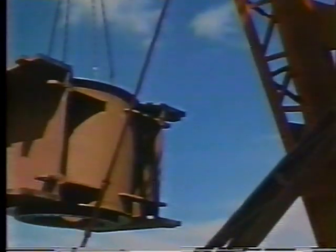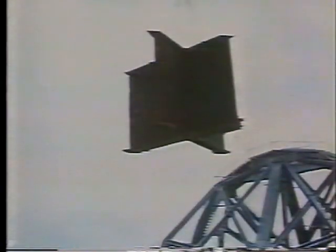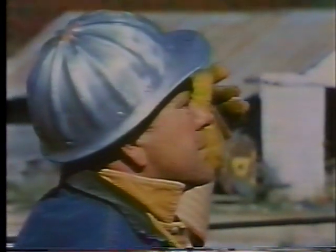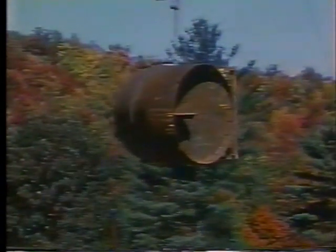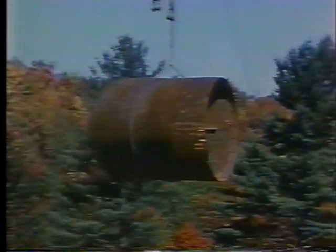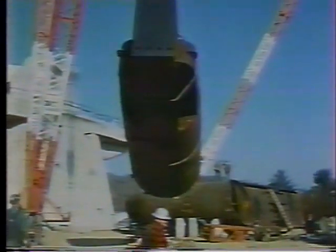Along with a dozen other sections that make up the yoke, the hub weldment made it to the site. Each section was fitted into its proper position next to the pedestal in the spot under the derricks where the superstructure had been. The yoke is an all-welded A201 steel structure involving many plates up to 6 inches in thickness. Completed, the assembled yoke itself weighs nearly 600 tons.